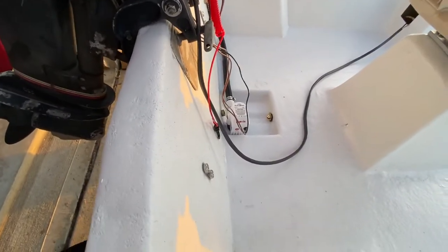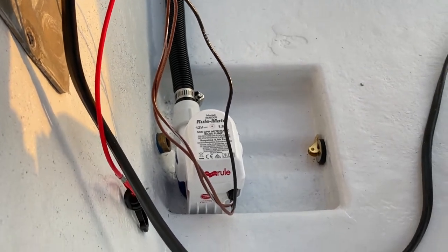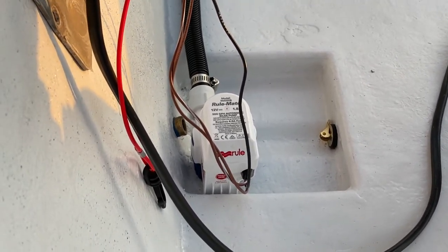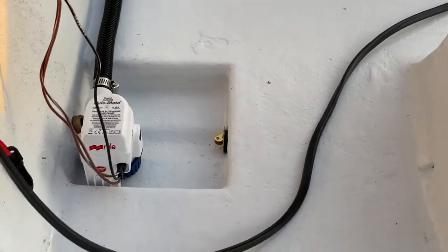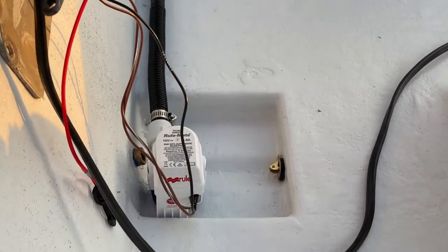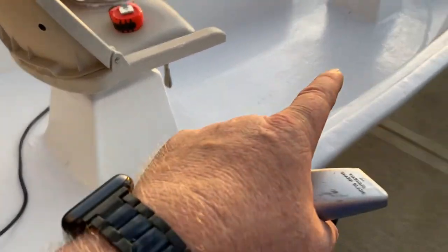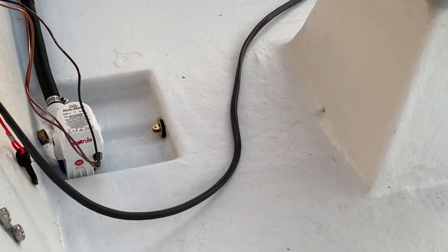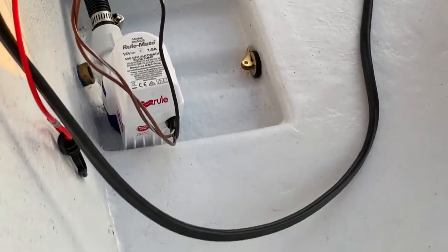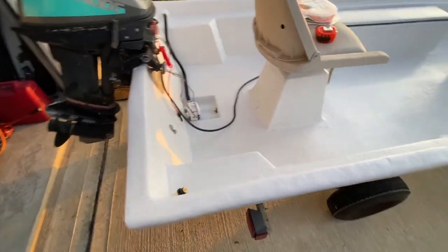Only downside — it's the horrible thing about this boat. You can see that plug right there. That's my drain plug. It protrudes through. I could have got a shallower one, but the next shallowest one I could find didn't come through enough. That trough actually has to fill up before water will drain out. It's got this other drain going into the subfloor of the boat, which isn't very thick at all, but it's there. I just don't like the fact that all the water runs into that subfloor. So I plugged it off. I didn't want to seal it when I was doing fiberglassing, so I plugged it off.